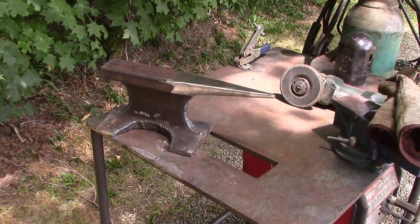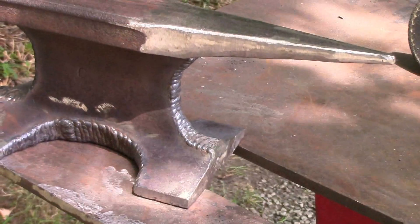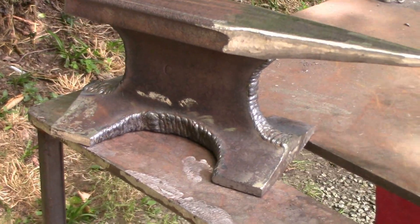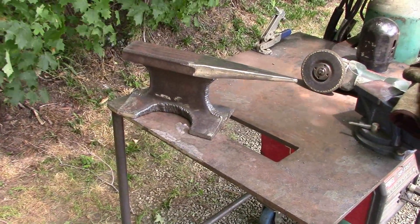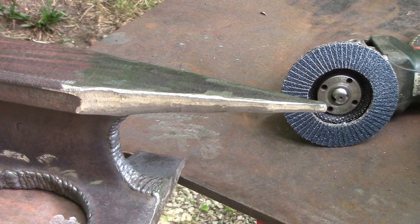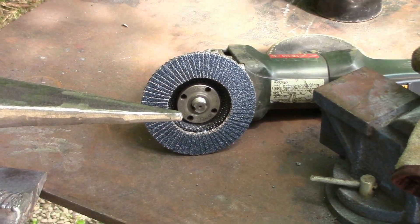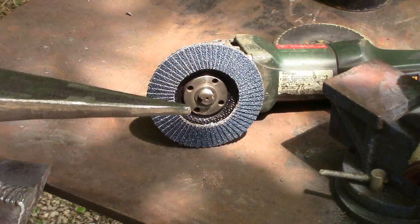Here's where we're at — we just finished up grinding with the stone. We MIG welded in the curved spots, and you can see we just blended it in with a low wire feed speed MIG weld, kind of blending it all together. Now we're going to go get the last grinding disc we need, which is just a flap disc, and finish polishing up the horn. This is the finish before the flap disc — you can see there are a lot of grind marks in it, not quite as smooth. The flap disc is 36 grit and it puts a nice little finish on her.